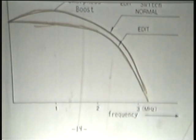And, you know, at first glance you'd say, well, what the hell? They put it in there to improve sharpness, and now you're taking it away and we're supposed to have a better picture. What are you talking about? The answer to that is noise. Video noise is high frequency. So this is their way of reducing the actual noise of the signal at this stage by eliminating the sharpness boost at this point. Does that make sense? Later on we talk about the noise canceller in the filter business. Right now we're just talking about the video frequency spectrum boosting circuit.